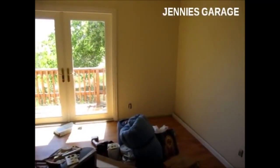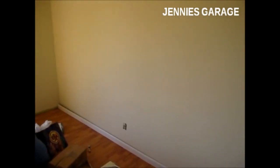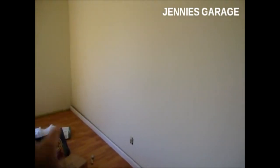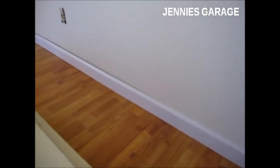I do a lot of projects around the house, and from time to time I need to find a wall stud. In standard home construction in the United States, 2x4 or 2x6 wood studs are placed 16 inches apart along a wall. If you need to hang a picture or, in my case, install baseboard, it's necessary to find where these studs are placed.